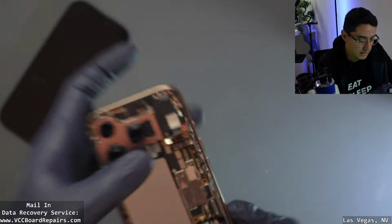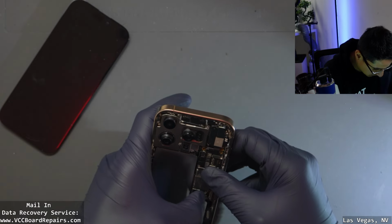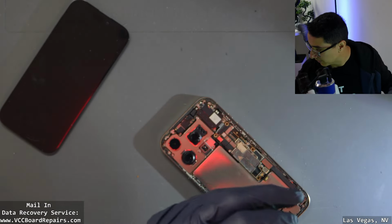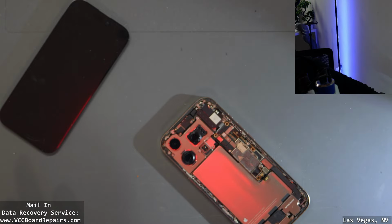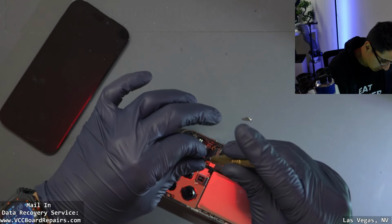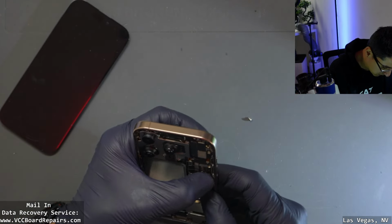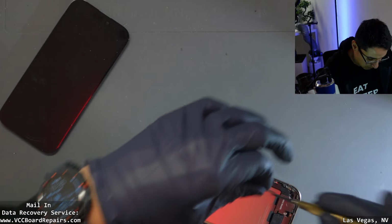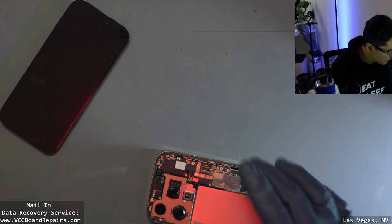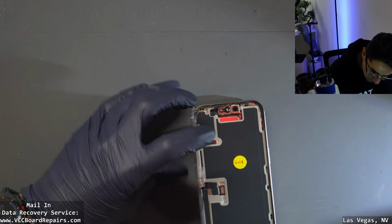So I'm plugging everything back into the housing. Another thing I discovered is that the only part that causes the 3-minute restart on these is the charging port; everything else does not. That's a good sign. That means fewer panic log issues like before, where all kinds of random parts caused restarting problems. I literally unplugged everything, and only when the charging port was unplugged did it cause the restart, but the weird part is the panic log was different each time. So there's that. Alright, here's the screen.